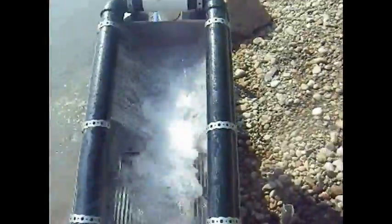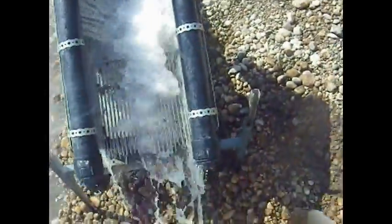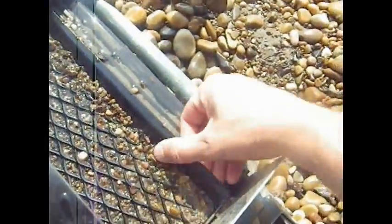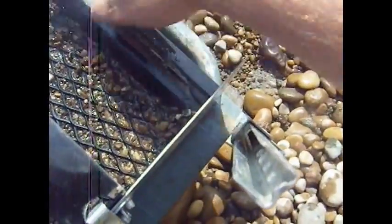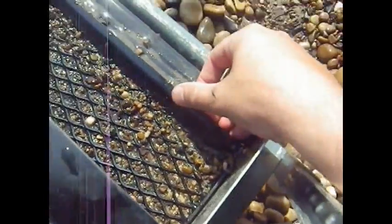I tried a little one-hand dig here just to show you how it's coming off — I just put it in and it comes right off. I'm going to let it run for a little bit longer and give it a good wash on the ground. So I shut it down. What I do notice is that it's much better at slower water than before — I actually have some build-up in here, whereas before I cleaned these parts right out. So hopefully there's gold that's been captured. Testing this new mat, I can tell this Hungarian riffle I welded in at the end I'll probably have to saw out. There's just some material stacking up here that I don't like — I'd rather have it go out, although I could deem it as a stop for anything that has made it this far.